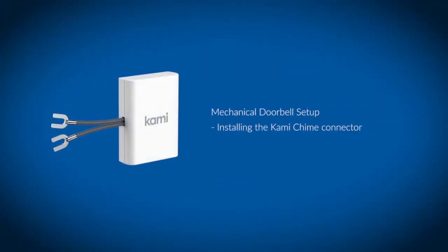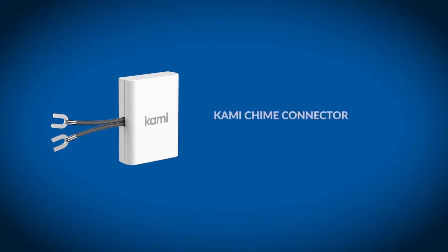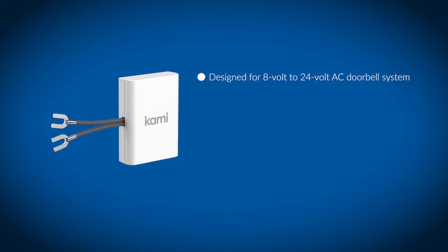If you are using a mechanical chime, please install the Cami chime connector provided in the box. The Cami chime connector ensures a stable power supply to your Cami Doorbell video camera. The Cami chime connector is designed for an 8 to 24 volt AC doorbell system, mainly used in the US. If you are using a Cami doorbell outside the US, your install method may be different. Check the included user manuals for details.